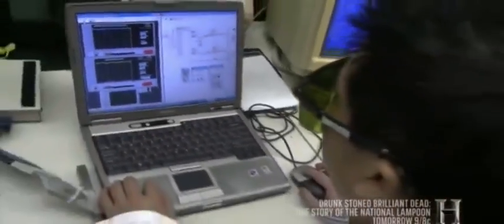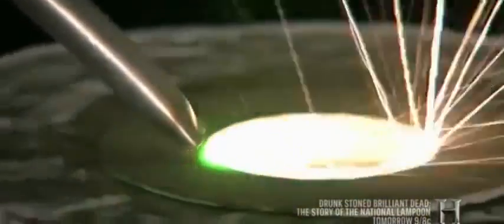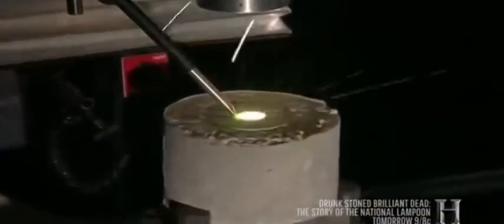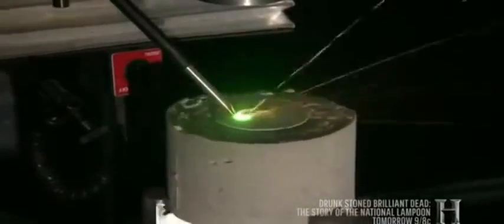To date, Claude Reed and his team have successfully developed the thermal fracturing method. The laser produces an invisible vertical beam, the size of a mechanical pencil lead, which shatters the rock fragments. An air nozzle blows the fragments off the surface. As each layer is removed, then the laser head would go down to the next level, remove the material, then down to the next level. And it just marches downward, step by step, removing each layer of material and taking it out of the hole.